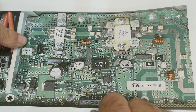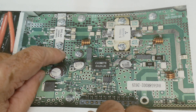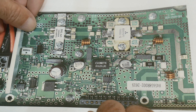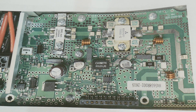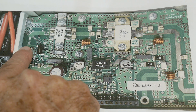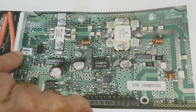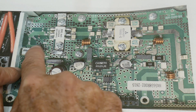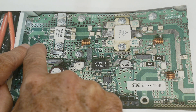We're going to get rid of these two chips and inject directly into this part. This part is capacitively coupled onto this node, but it also has a resistor — so it has both a DC path and an AC path to bias the gate voltage of the FET. We want AC coupling before this input impedance. There's a capacitor right here, so we'll remove this part and inject our signal where its output is. That output is tied through an inductor to plus V, so we need to remove that inductor as well.